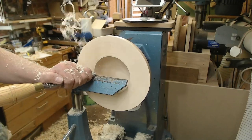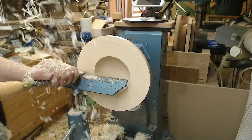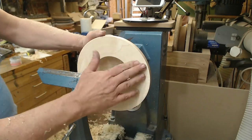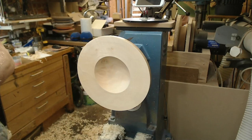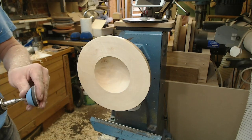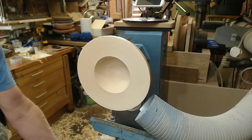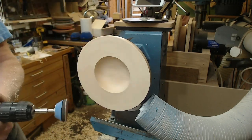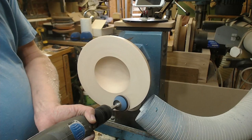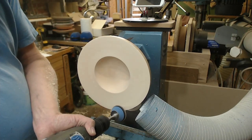That's done with a swinging of the handle — you can see the bottom has now lost that little nub, the little line that was there is gone. Just using one part of this curved edge to make a straight edge, drifting it along quite light — you can see quite soft shavings on my hand. It is mesmerising, something I could carry on doing for much longer than necessary, and then we're back to what you've all been waiting for: sanding, round two. Get your tool rest out of the way — this is a short bed lathe so I find it easier to remove the tool rest completely sometimes. Dust extraction on and we're back to 120 grit. This took a little bit more sanding than the outside for some reason — maybe I was just a bit heavy-handed.